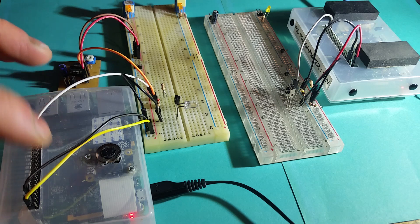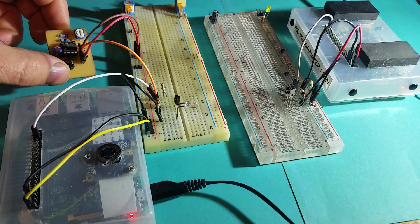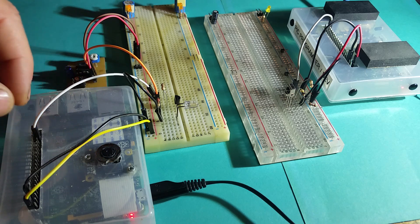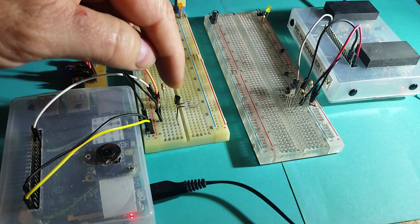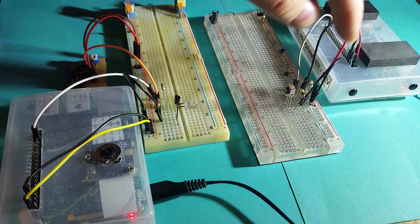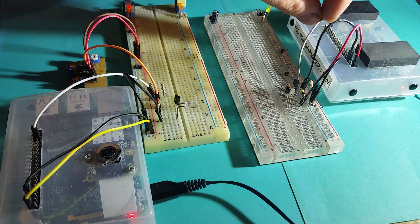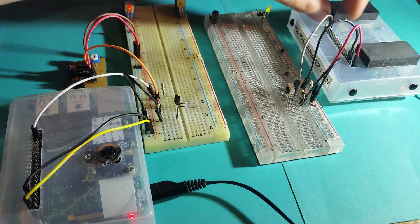Each Raspberry Pi only has three wires going from it to the breadboards. On the transmitter side I'm using five volts, because the 555 timer is powered from five volts. The GPIO pin comes over to switch the transistor on or off — it's held high internally in the Raspberry Pi, and it pulls the transistor output low whenever it wants 38 kilohertz to go through to the LED. On the receiver side I'm using 3.3 volts, because the infrared detector can run off 3.3 volts, and its output goes onto a single GPIO pin.